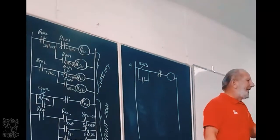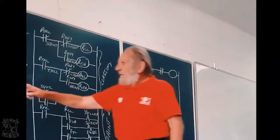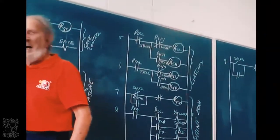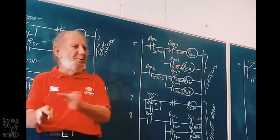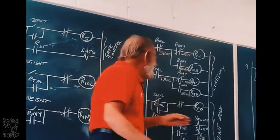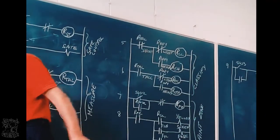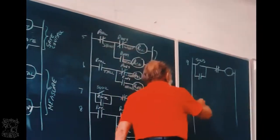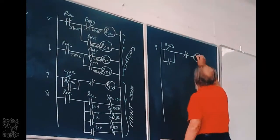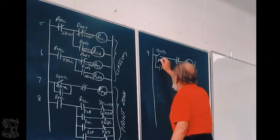What must happen if it touches switch 3? One of these four flaps must move to push it off the conveyor belt, isn't it? So it is entering the divert zone. So let's give this relay the name Relay divert zone. And we latch it.